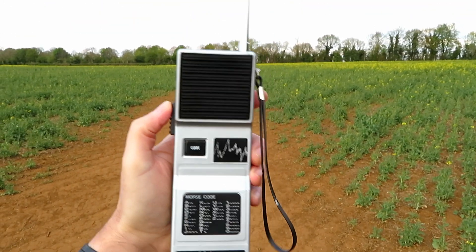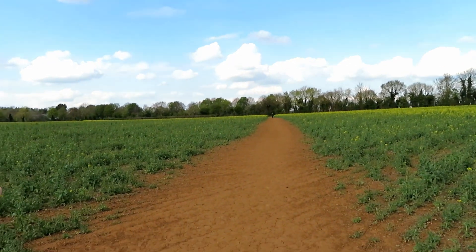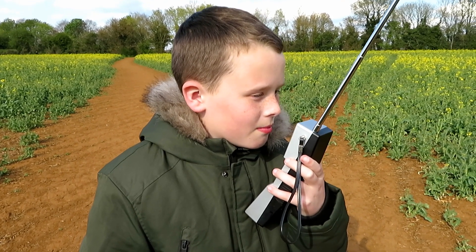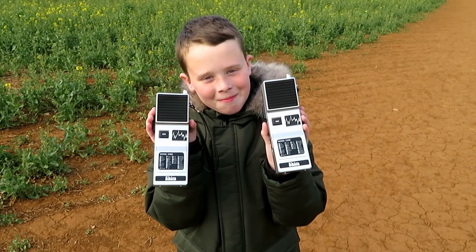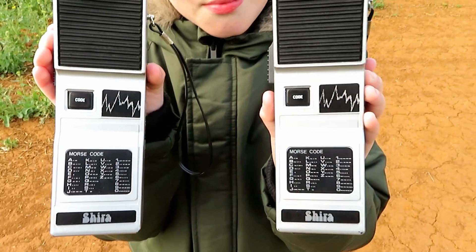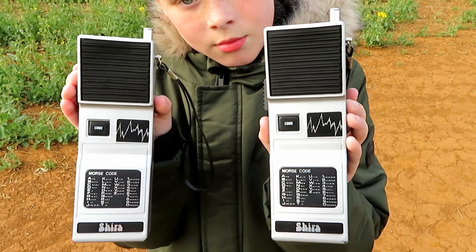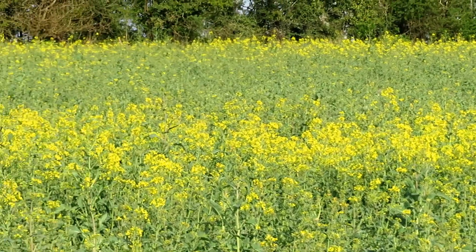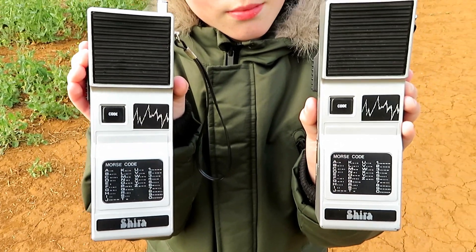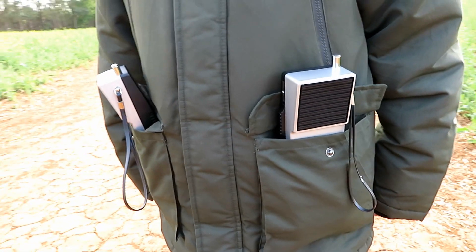This is about the right sort of distance, this is about your limit. Give us the quick brown fox — 'brown fox just went over the lazy dog.' There we go. One thing you'll find with a lot of these radios, the 49 MHz and 27 MHz underpowered sets, is that one radio will be better than the other — one is slightly better on transmit, or one receiver is slightly less sensitive. It is the receiver that lets these things down mostly, they're very very wide. You shouldn't worry too much if these are slightly off frequency because the receiver side is incredibly wide.